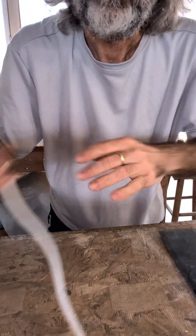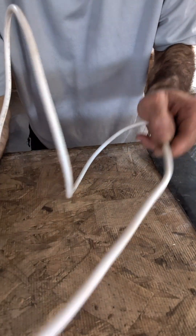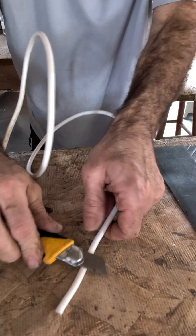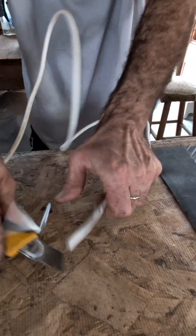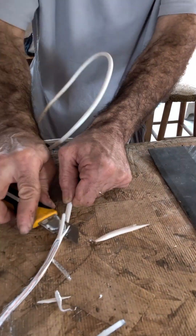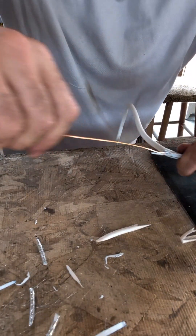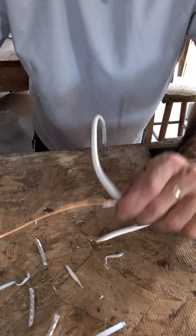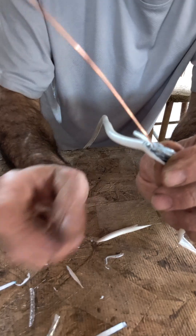The connector is what's going to go into the TV. I'm cutting it — you need to strip it for 8 inches, about 20 centimeters. You can't really use strippers because the foam is so stuck, so you just use a knife. I've got about 8 inches; I'll cut it here and then go install it on the TV.